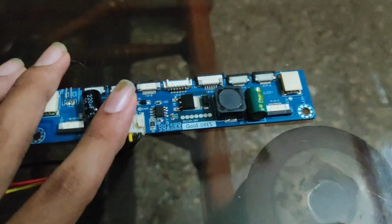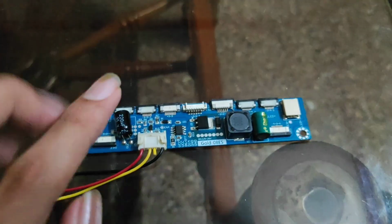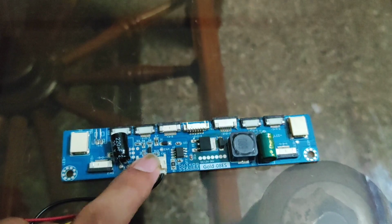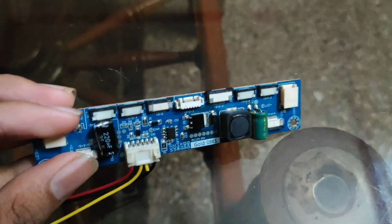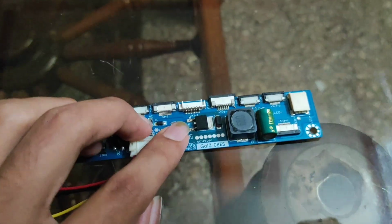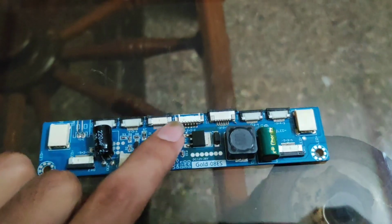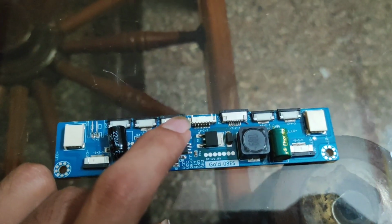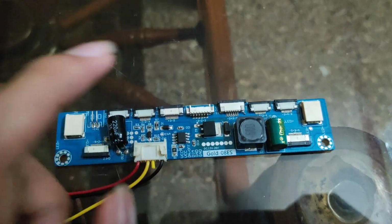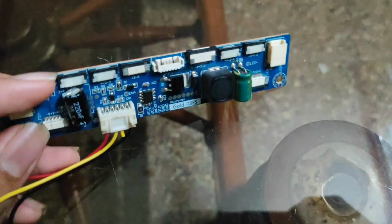Friends, before using this, you have to make sure that first you check your backlight voltage. If your backlight voltage is below 45 volts, you can easily use this backlight driver. If you give more load to this backlight driver, it will run for some time, then it will be in dead condition. So in the next video I am going to show you how to install this backlight driver to any type of TV. So this is all about my video.